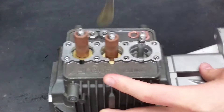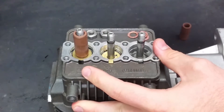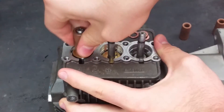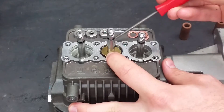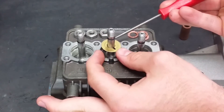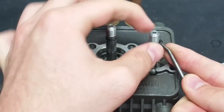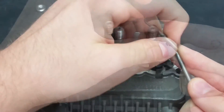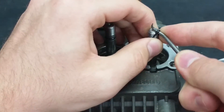To take off the pistons, you must twist and pull them off of the piston rods. With the pistons off, you can now remove the brass slingers. Next, remove the O-rings on the piston rods. Be careful the O-rings don't go flying away.